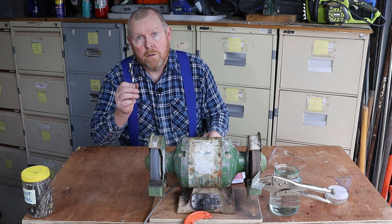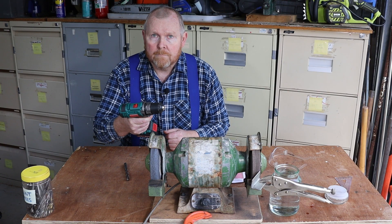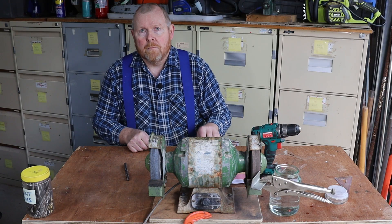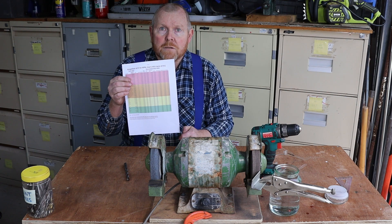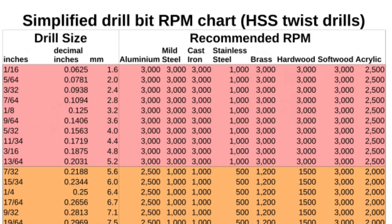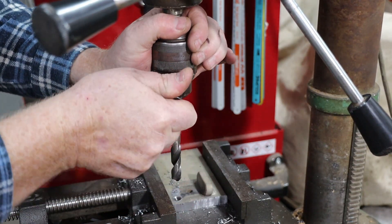So with a bit of luck we've now got a sharp drill bit. Before we go over to the drill press to try it out, let's talk a little bit about drill speeds. Most home workshop cordless drills will have a two-speed gearbox as well as variable speed on the trigger. If your drill bit is a quarter inch — that's six and a half millimetres — or less, use the high speed. If the drill bit's bigger, use the low speed. If you have a drill press, I've put together a simplified drill speed chart. For general home workshop purposes you don't need to use a precise RPM. This drill bit is 11 and a half millimetres, and according to our chart, to drill in mild steel we'll need about 600 RPM. The closest I can get with this drill press is 550 RPM.